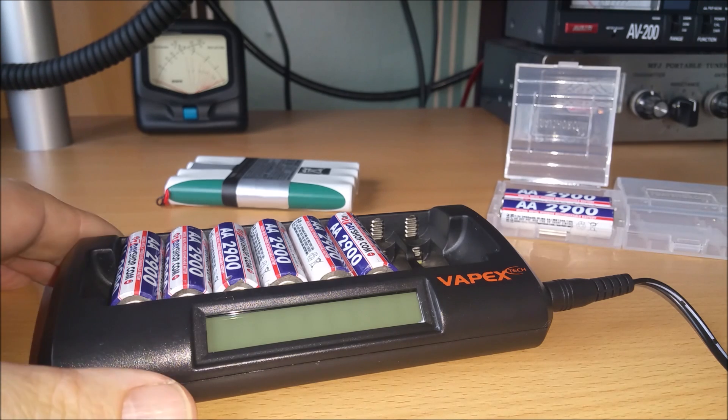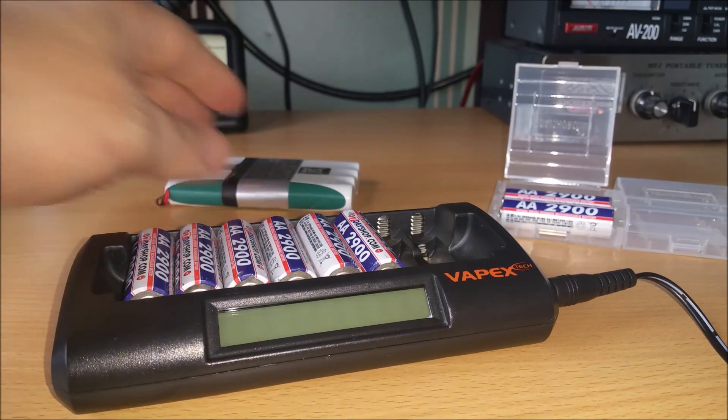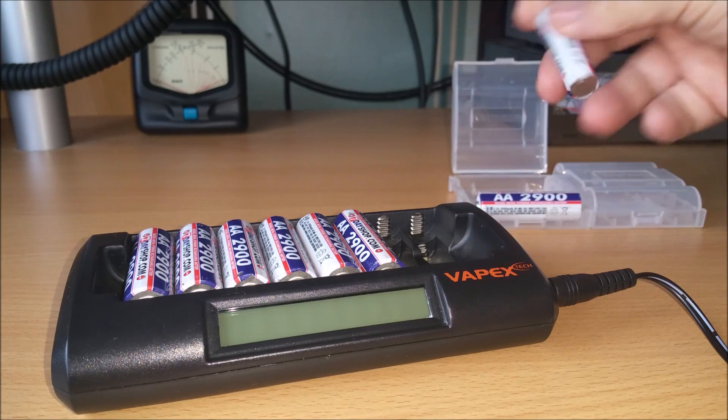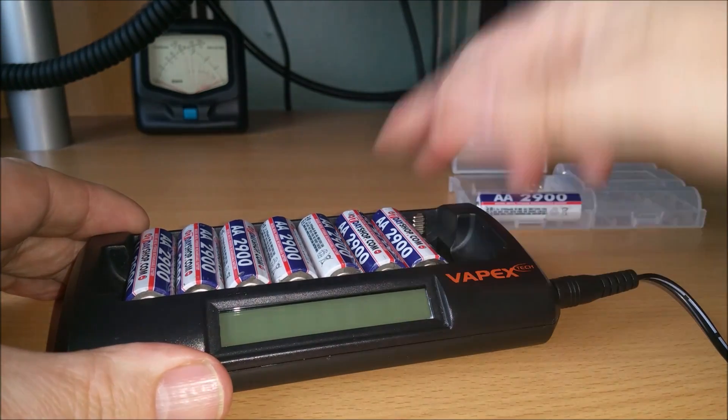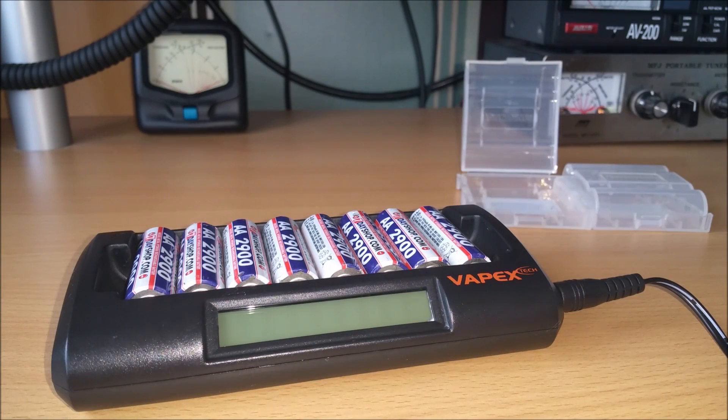This charger and 8 AA batteries rated at 2900mAh — the charger and the batteries together cost less than what a replacement genuine 817 battery would cost. It's a nice little charger that takes 8 AA batteries and will also recharge AAA batteries. The 2900mAh batteries take about 5 hours to charge, and then the charger switches over to trickle charge if you leave them on any longer.